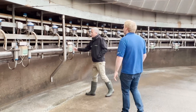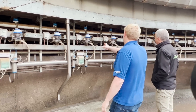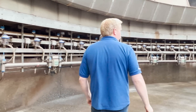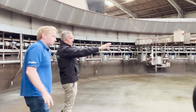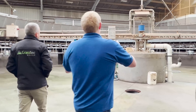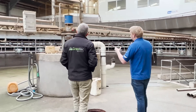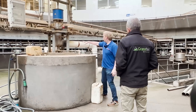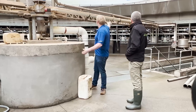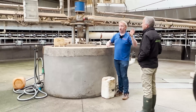The drainage here runs from the center. In some other setups it would run through the rotary and back to the outside, but here the drains are on the inside. The large central pillar is structural — with this center pillar everything's tied together, so we don't need rollers running H-beams to keep the center. The center structure holds it together; these are large and bolted on, they don't float, and that lattice structure keeps the rotary central.